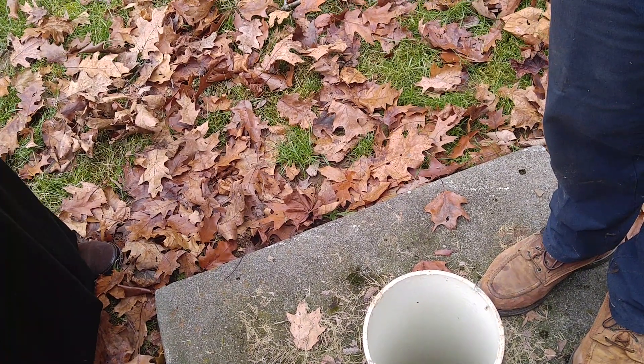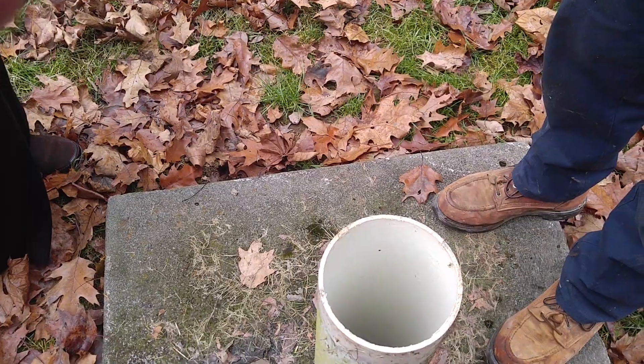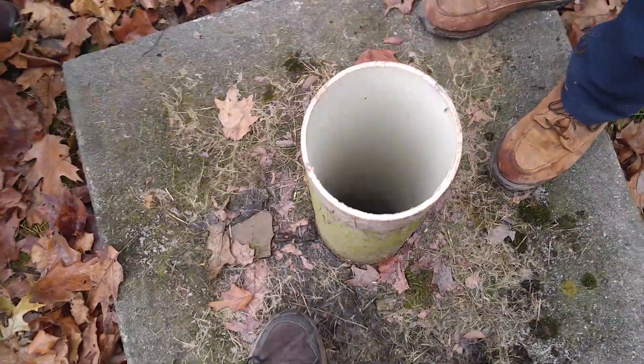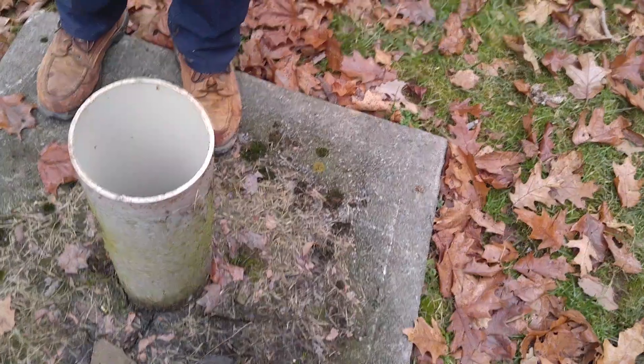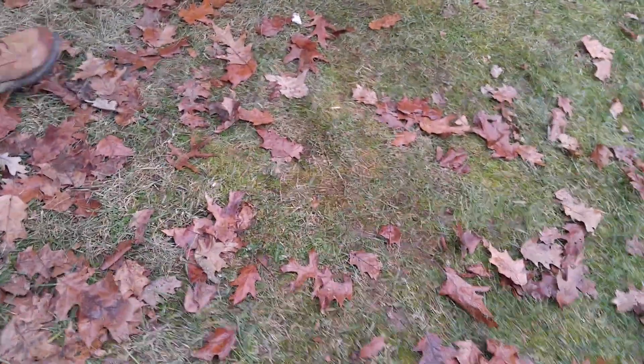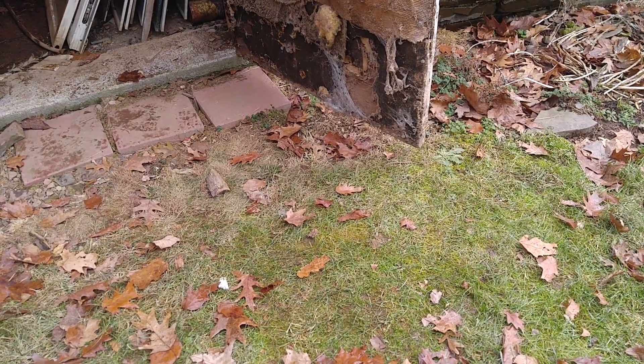Make sure your pipes are clean going in — one little chunk of dirt will cause trouble. Put it back in, otherwise you'll have the same problem. Slide it back down with your hands, hook it back in, then take that plug out and start pouring water until she's full — probably five to ten gallons to prime it. Every 10 feet of one-inch line is about a gallon, so that's how much water it takes to fill it.